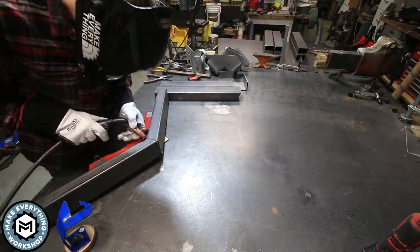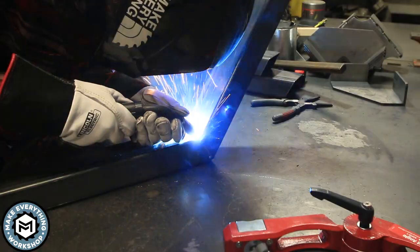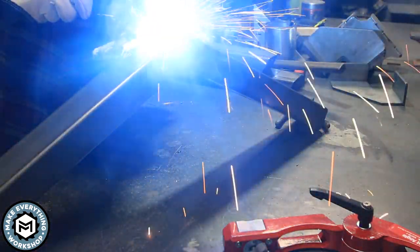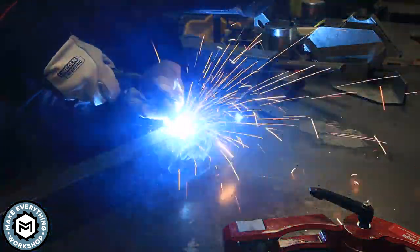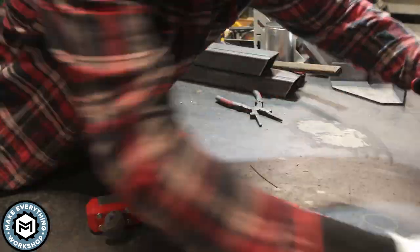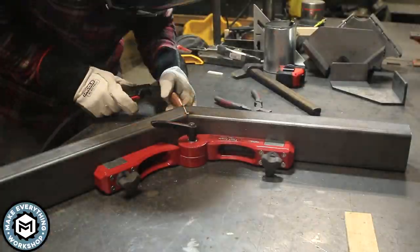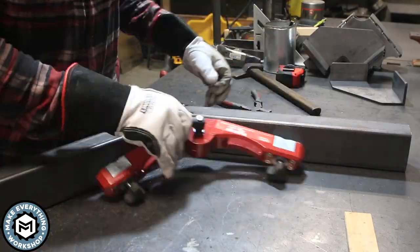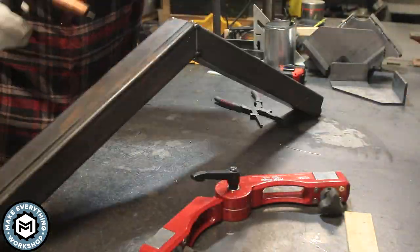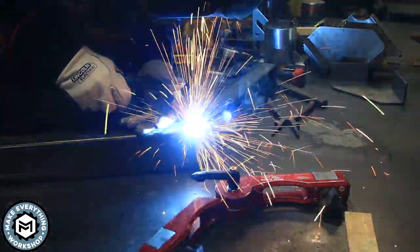I'm using the angle magnet to clamp this work, welding the outside with some tacks, then going in and welding the inside and outside with a full bead, coming around the piece full circle. I'm going to be grinding all these welds flat, but I want to make sure the piece is extremely strong — hence why I chamfered those tubes beforehand. I put real solid beads on here just to make sure everything stays nice and tight.